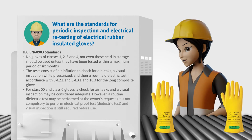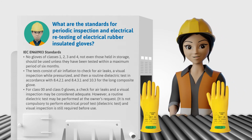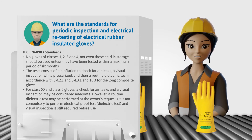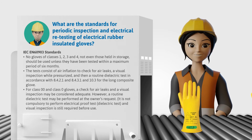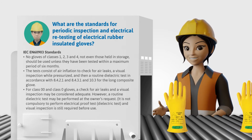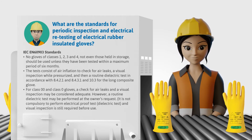IEC EN 60903 standards note that no gloves should be used unless they have been tested within 6 months. Class 00 and Class 0 gloves must be checked for air leaks and also visually inspected. It is not compulsory to perform an electrical proof test, but visual inspection is still required before use.